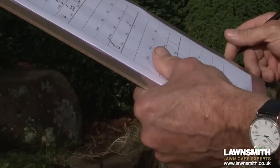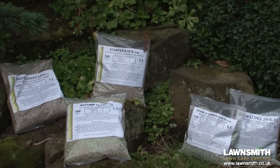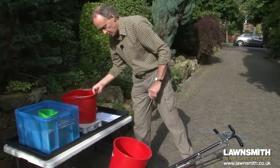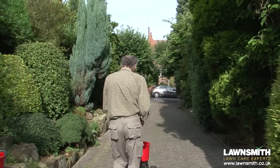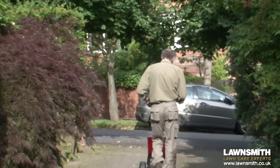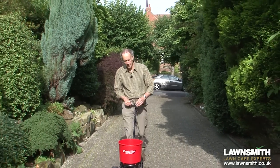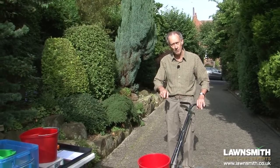Right, so we're going to do another set of readings. This time I'm going to move my dial up one and set it at number 15. I need to bring my fertilizer back up to two kilos, pour that in, and off we'll go and do another set of readings. Start just before the line, open it up at a steady pace, shut it off as I cross the line, and same procedure on the return. Now, as we've already done most of the calculations previously, all I need to do now is weigh the fertilizer.